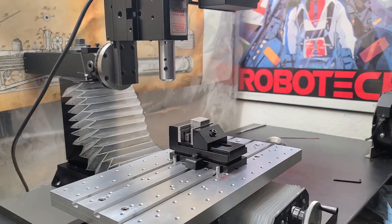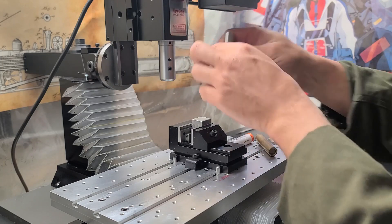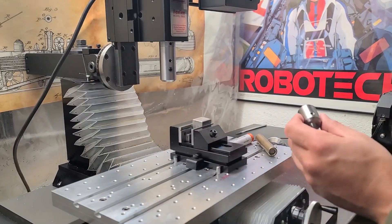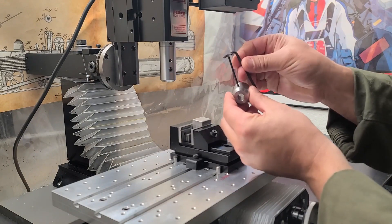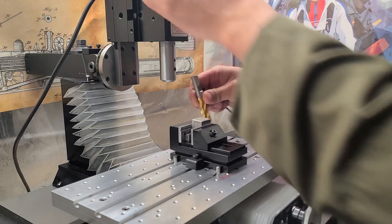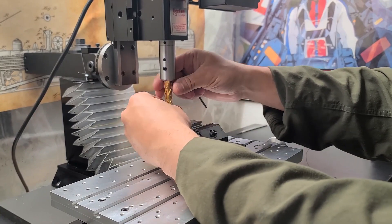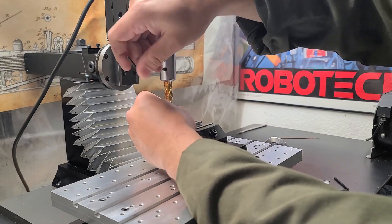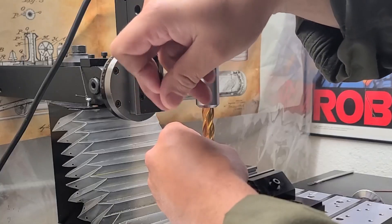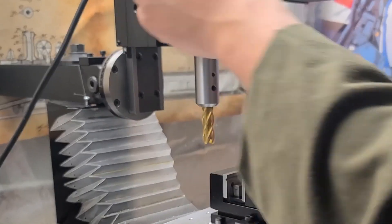I'm really excited and looking forward to using this titanium nitride American four-flute cutter, but the standard small Sherline hex key that comes with everything doesn't fit it — it actually requires a one-eighth. I think that's fair though, because if someone's going to be running a half-inch cutter they probably should own a full set of hex keys anyway. Pay attention here: as you can see, the flutes start to turn just a little bit as the set screw bottoms out, which is something I never noticed on the smaller cutters.